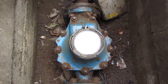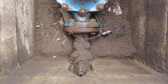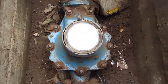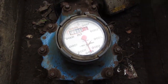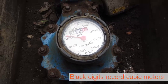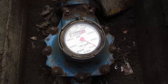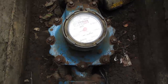It's 50mm in size, which means that the pipe entering the meter is probably a 2 inch and the pipe leaving is probably a 2 inch. The dial has 5 black and white digits, 2 white on red digits, the black digits recording cubic metres, the red digits recording litres.